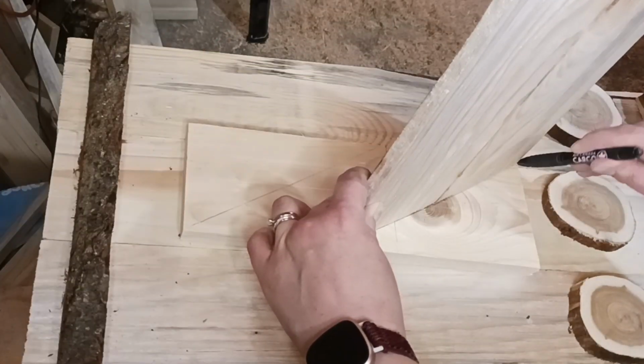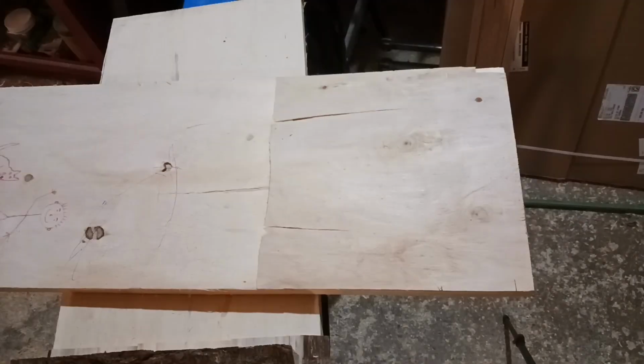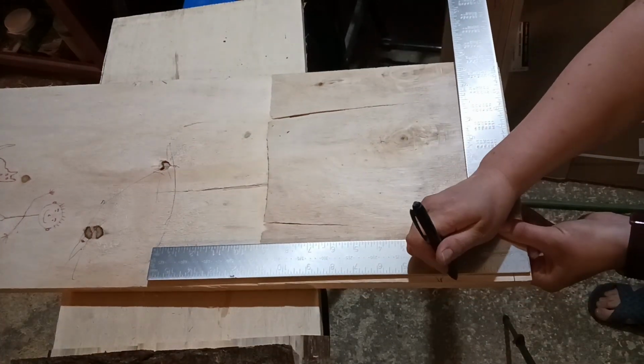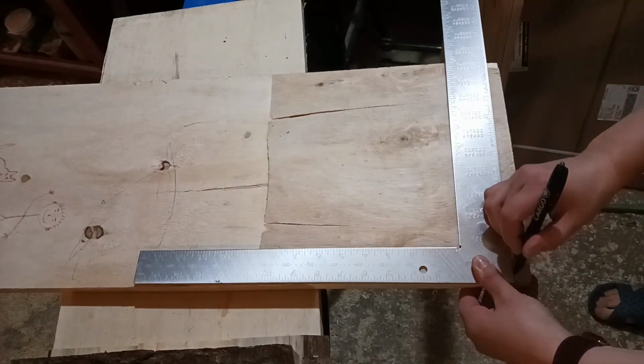While measuring out the triangular sides of the letterbox, I switched to the other side of the piece of wood because I want to incorporate the knot. Now I'm measuring a piece of scrap wood to create the jig. I use a 2x10 board, trim off the rough edge, and leave a couple of inches before starting the angle downward. The first time I saw this type of jig was on another YouTube channel, which I'll also link in the description.